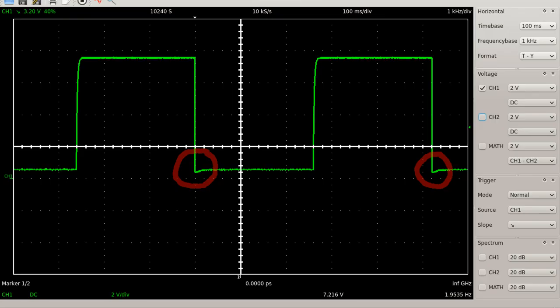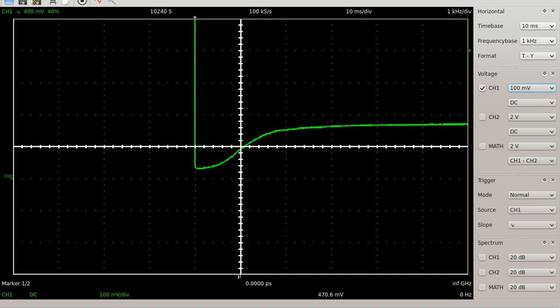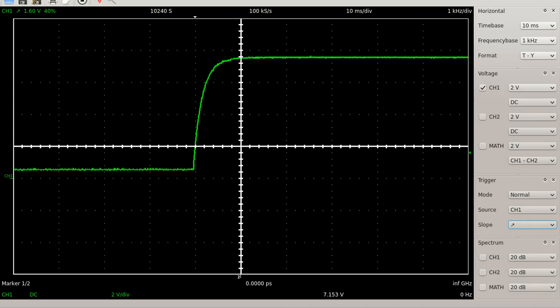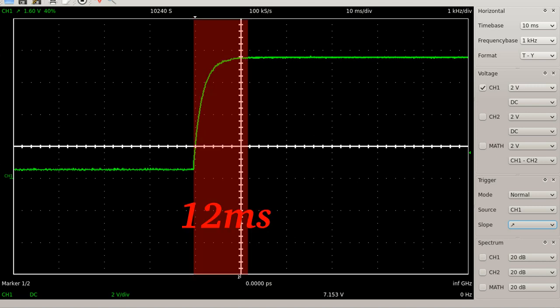At the falling edge of the signal, the corresponding transistor is turned on, hence its resistance is minimal. Consequently, there is just a slight distortion of the signal at the lower end of the falling edge caused by the disequilibrium of charges inside the capacitor. The slew rate at the rising edge is lower the higher the capacitance and the resistance of R1 or R4. The corresponding transistor is turned off, so the resistance of the emitter-collector line is at its maximum, and the charge equalization is done via R1 or R4 — the voltage increases more slowly the higher the resistance of those devices.